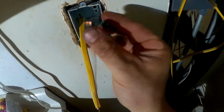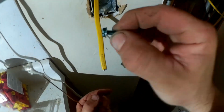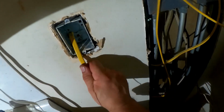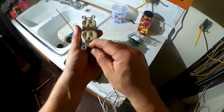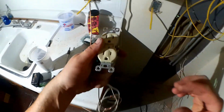affixed with a proper ground screw, not the wire clamp screw or anything else. Those are not designed to hold a wire very well, and they don't. And that's not a flat surface there that you're putting it on. These ground screws have kind of an enlarged washer-like head there that will keep a wire in place. And pretty much all the metal boxes have threaded holes, usually more than one, for such screws. There are some modern devices that add an extra little metal clip on the mounting point here that's supposed to bite into the mounting screw and is then approved as a means of grounding the box. But let's not assume we're going to have that, and this is better.